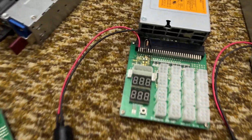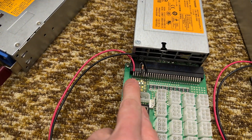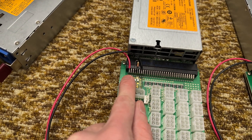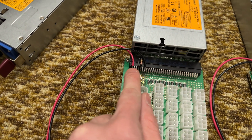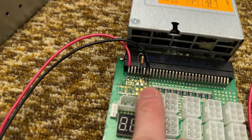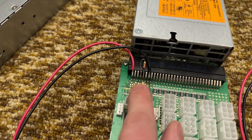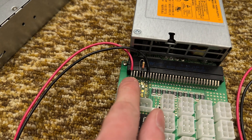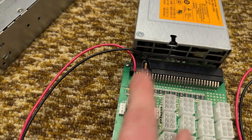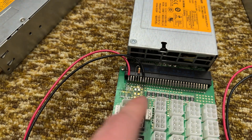It's pretty straightforward. Looking at the socket on the back from this orientation, start from the left and count the pins. That red wire is on pin one, then two, three, four, five, six, seven — there's a black wire. What you need to do is get a 22 kilohm resistor — 22,000 ohms — and solder it onto the legs of pins three and four. It doesn't matter what direction. Really easy to do, straightforward, as long as you don't get solder everywhere.